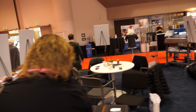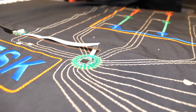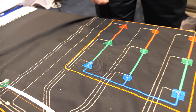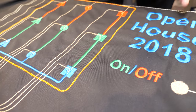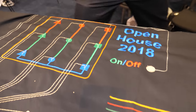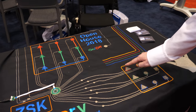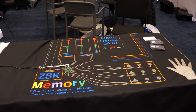On this one we have a smaller board designed in-house, optimized for embroidery. Up here you'll see small LED sequins — as long as a chip can be mounted onto a sequin, we can place it down and connect it electrically very reliably. This board has a capacitive sensor to test and reset this little game: you tap the hand to start it, and it prompts you to press specific colored shapes in sequence — a simple game detailing how we can embroider different types of connections.